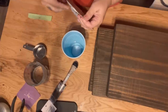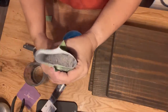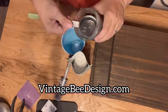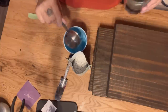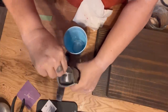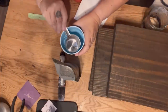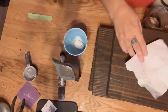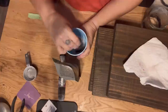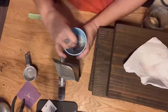For these boards I am going to use Miss Mustard Seed in the color Grain Sack. We currently have it on sale as we're getting ready to stock all the new formulas — most of our Miss Mustard Seed is at a very deep discount, 40 to 50 percent off in most cases. Milk paint is really easy to use: it's simply equal parts water and powder, and then you mix that up and start painting. Here I've added a quarter cup of water and a quarter cup of powder. I'm going to lightly mix that up and then let it sit for a few minutes so the powder can absorb into the water, then come back and mix it again and it's good to go. I love the creaminess of it.